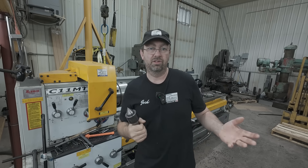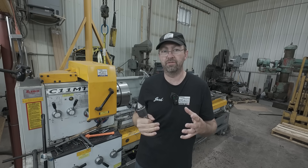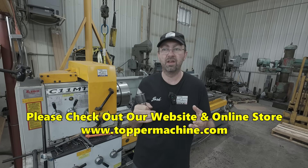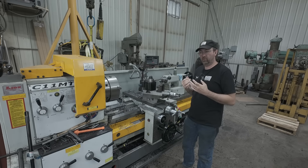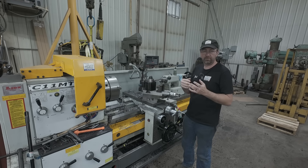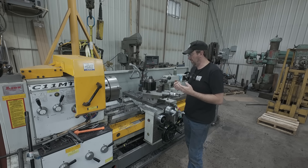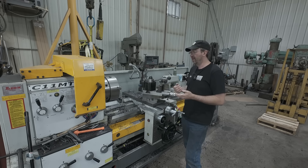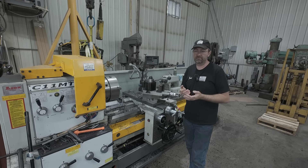The Interstate from MSC has been a wonderful center as well — no complaints there. That really sums up why I was having so many chatter problems with that job, or a good portion of it. We're still going to have some chatter on a job like that, but the center was definitely a problem. The center problem came on gradually — not all at once. I noticed a few things here and there over the last month or so, and I have videos where I'm using it that'll be coming out in the next month. But the real failure became obvious with that job — I had to switch it out to get the surface finish I needed.